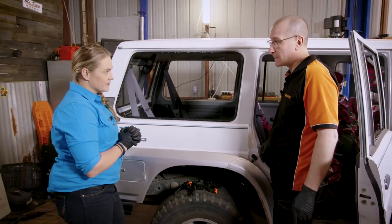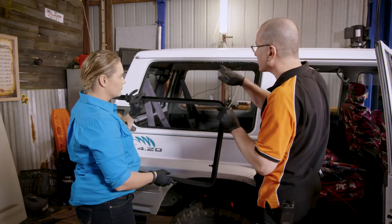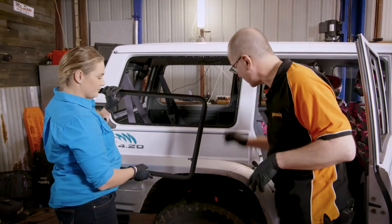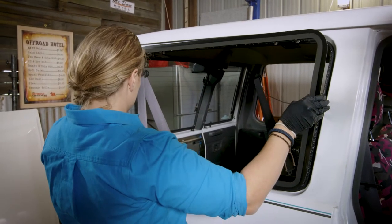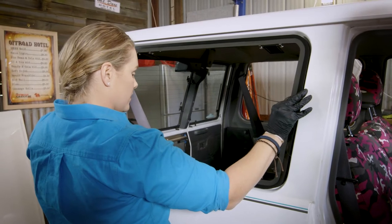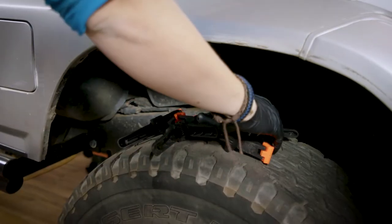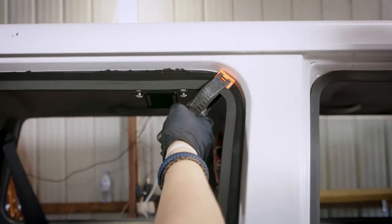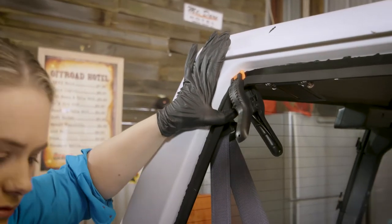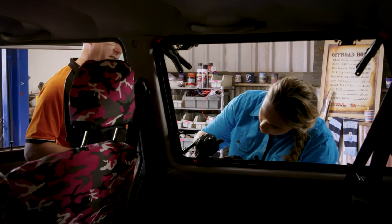So we're now going to put the frame in. Now, what's important in this process? Just mind these screws at the top — don't get them into the glue. Set the top in first, then set it centrally as much as you can. The clamps are nice and close by, so pop them straight onto the corners. Tell me if I'm in the right direction. She's on — hold it in place as you reach for a clamp; that's where you appreciate having the clamps close by. It's not as important to get it sort of perfect — mainly it's important to get these clamps on, and it will adjust to perfect in just a moment.